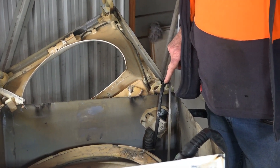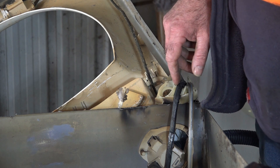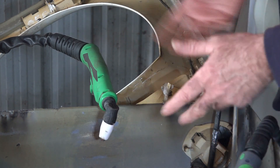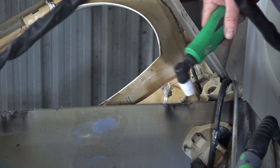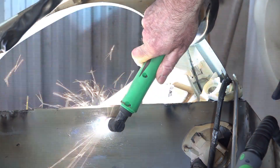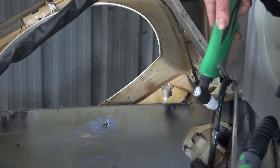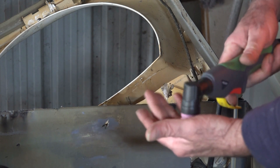So if you have a look here, you see I've got some wires and stuff still hanging on here. Now I'm too lazy to go and get a pair of cutters because it takes too much time. So what I want to do is just use my plasma torch to cut them off, but unless it's pilot arc it won't work. Here I'll show you again. If I use my non-pilot arc plasma torch - look what happens - absolutely nothing, because I need to touch it on the steel. See it was even hard to start there because it's undercoated here. So you need to hold it on the steel to get it to cut, but if I want to cut through wire it won't cut. But if I grab my pilot arc torch - remember I took the guide off so I can get closer to the wire - watch this.